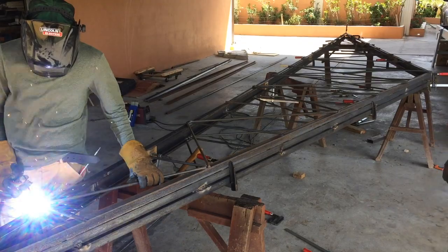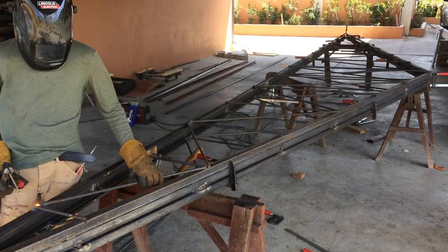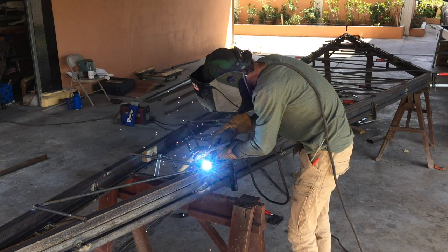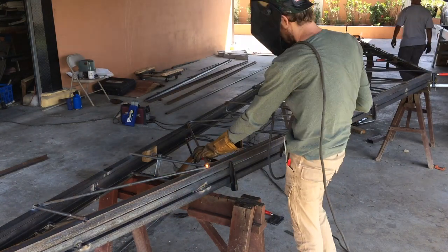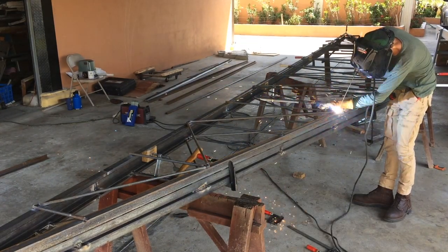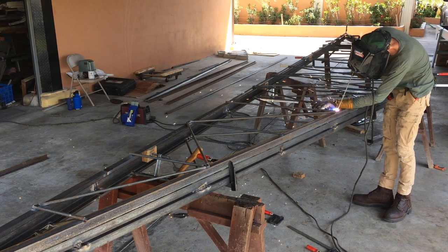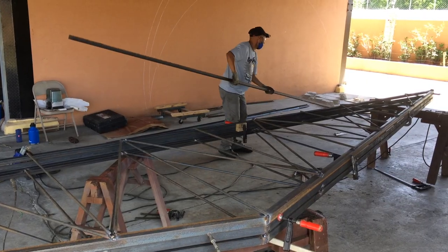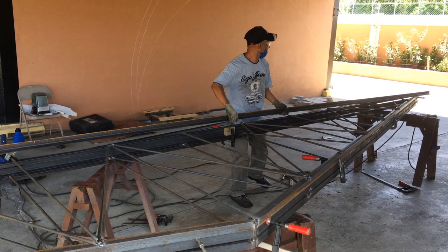And one of the great things about a truss design like this is that you can scale it to a lot of different sizes very easily. There is a wide range of angle irons available with different thicknesses, as well as bar, and you potentially could even use some kind of tubing as the webbing as well, and that worked great. So right here you can see we're putting on the last angle iron on the top